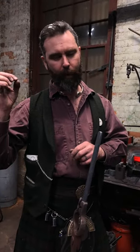And I say that very loosely, because those folks who are using, say, salt pots and things like that, where they're really controlling their temperatures, are probably getting even better results than I am in a convective style heat treat oven. So obviously there's always that eternal refining of how good you can get that heat treat. And I also feel there's got to be a point where the benefits have outweighed the effort.